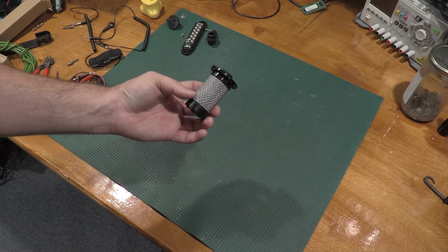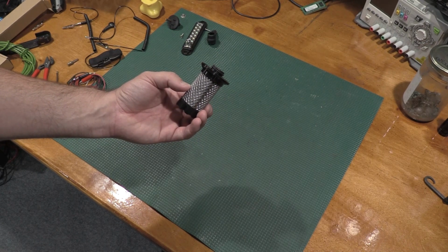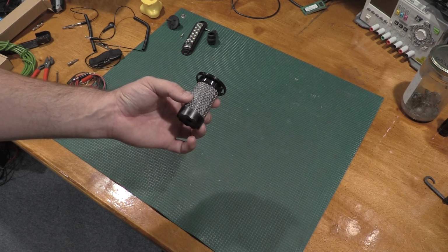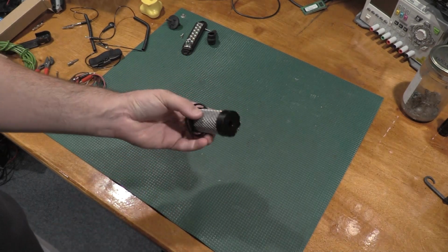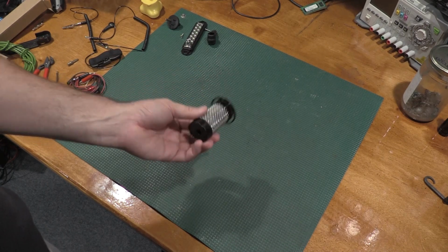These charcoal canisters are a final solvent gas trap in the airline to protect the N2 filter, which is horrendously expensive. But these are only good for about 3 months. So every 3 months, depending on use, you have to change this out. You should see no water or any vapor left in here.